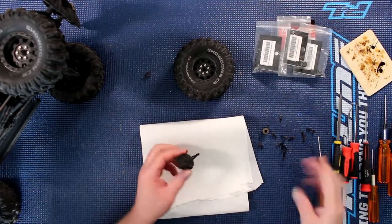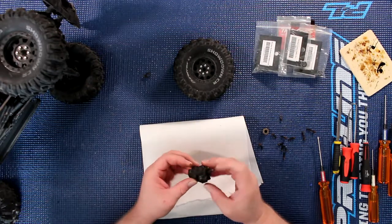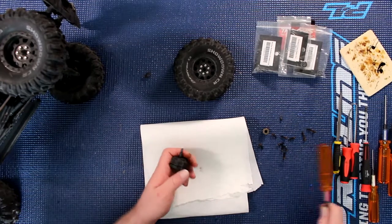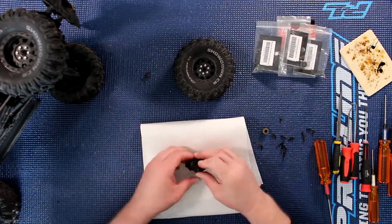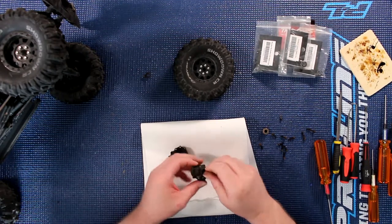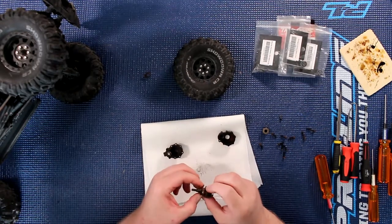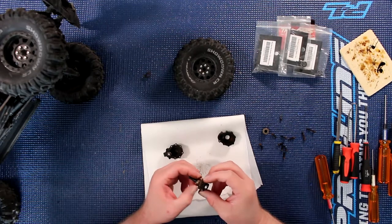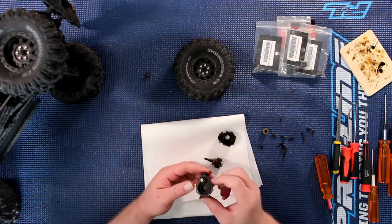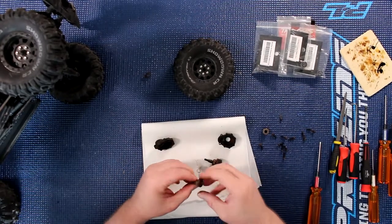We have the last screw here. Basically I just grab the top of the case and push on it, making sure I didn't forget a screw because it's tight. Knock on it a bit. Sometimes you need to be a little bit forceful with it. The back ones were a little bit worse than the front — we've got a little bit of rust here. To remove this bearing, it's basically the same thing: give it a couple of knocks. We got the first bearing out.